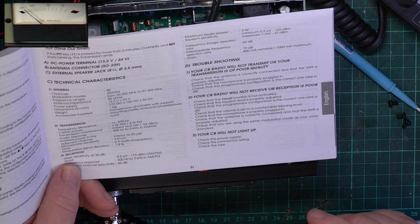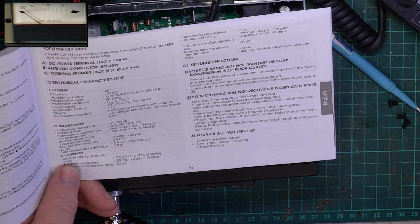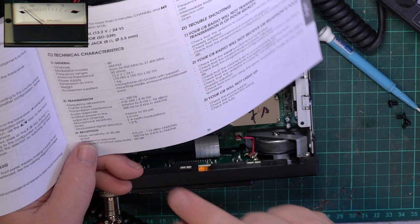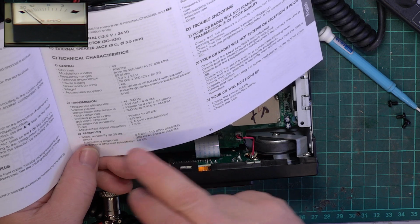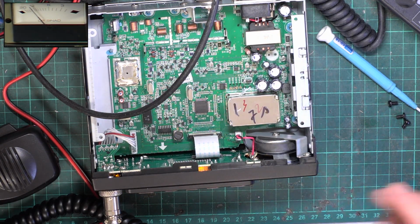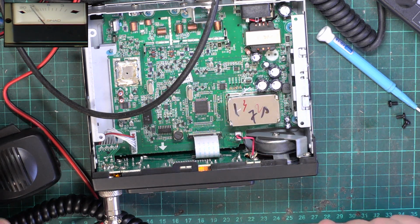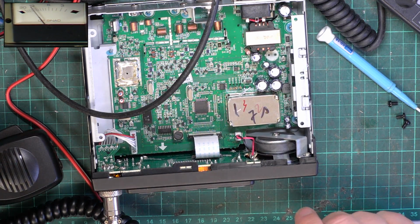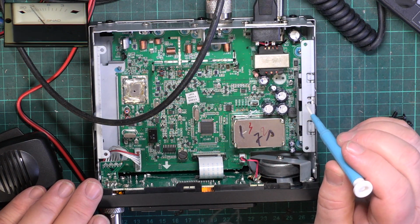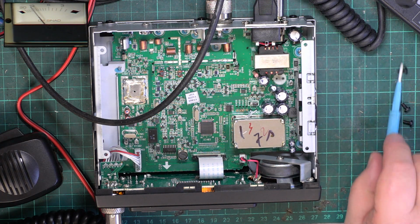So now I can make it do 20 dB Synad for 0.31, that looks like. It's right on the edge of the scale. I'll just do it with the other one. Yeah, not actually 0.3, 0.31. So in which case, that's better than what they say. So it's all very subject to how you do the readings. But it works very well, and that's what it's about. So I'll go do some research, and we'll see if we can find out. I don't think there'll be any hidden menus, but I just want to ascertain that is the power. It looks like it is, and I want to ascertain that that's the FM detector, because otherwise I'm going to have to mess about and go into AM.